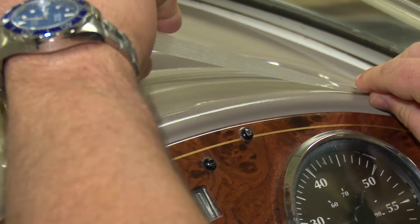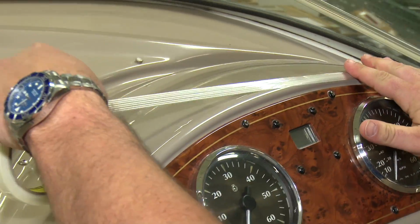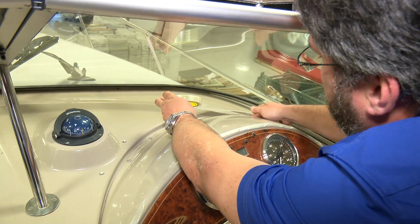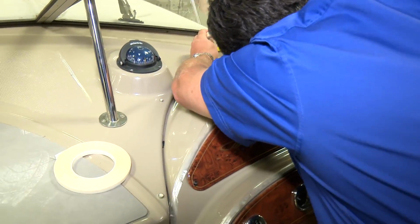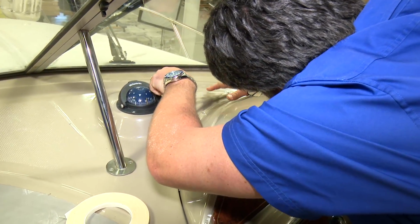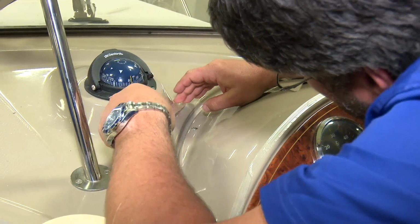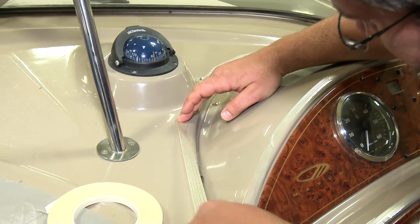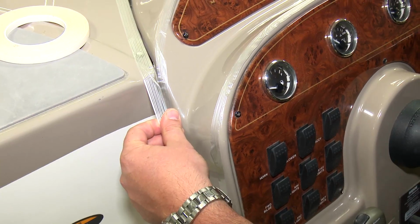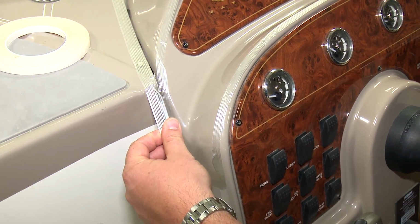Because of that fact, Brian has decided that our helm cover will be made from 3 separate sections, so Brian will place a run of 3M strapping tape where each separate panel will eventually be seamed together. You will notice that snap studs are already installed in the fiberglass. The tape is being applied directly over those snaps. When it comes time to cut the pattern, we will have to remember to move the pattern edge out at least a ½ inch to accommodate for the snaps.